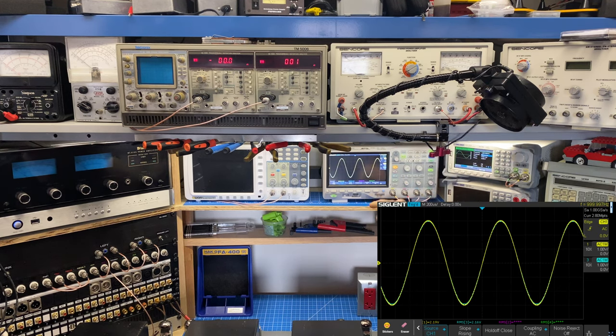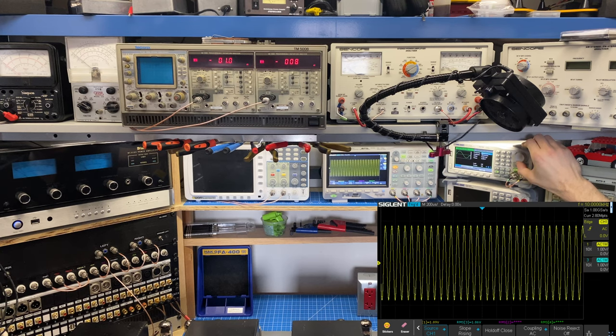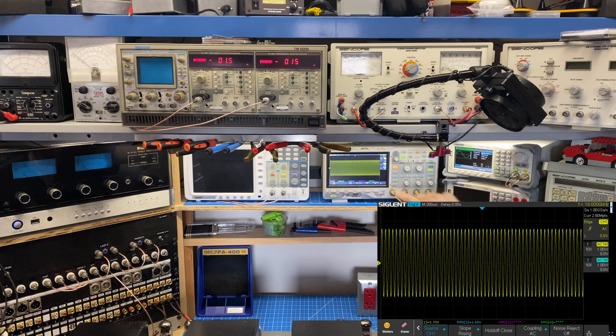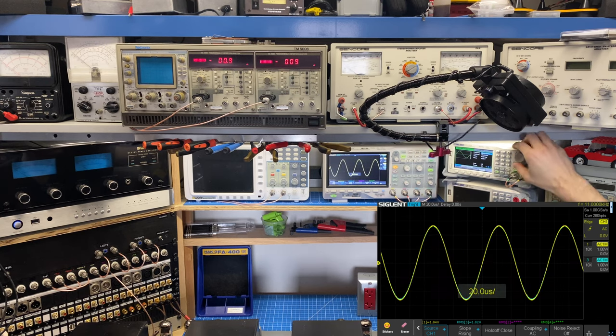There we go. So I've got both of my waveforms overlaid and they are right at this line here. What I'm going to do on the signal generator is basically simulate what we were doing with that plot. So as I increase the frequency, our goal is that the amplitude remains the same. You can see that around 12 kilohertz, my amplitude is starting to drop. And by the time we get to 20 kilohertz, it's shrunk down a little bit. But the main thing is that throughout this process, both my channels are tracking near identically.